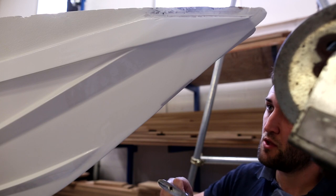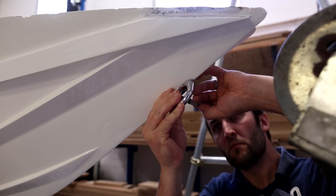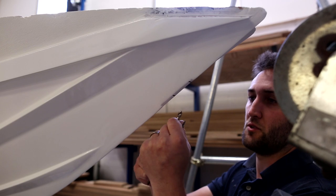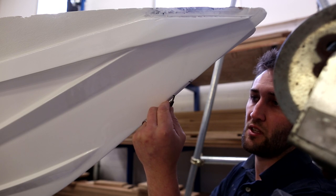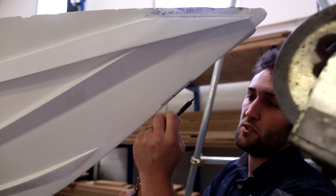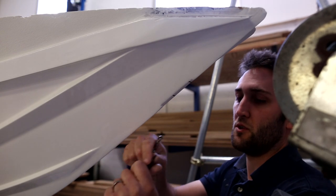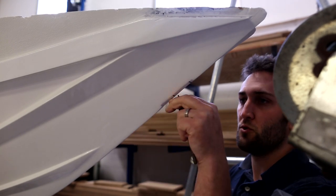The first thing to do is going to be to mark the holes, and then drill the oversize hole. It tends to be cleaner if you drill the larger hole first, and then the smaller guidance hole through the centre of it afterwards. You can do it the other way around, but it's sometimes a little bit difficult to centre a larger drill within a smaller hole. Your larger hole should be roughly a quarter inch bigger than your smaller hole. I've got an 8mm bit here for the M8 thread, which is going to give me my guidance hole, and then I've got a 14mm bit which is going to be my larger clearance hole. So I'm going to go in a short way with that first.